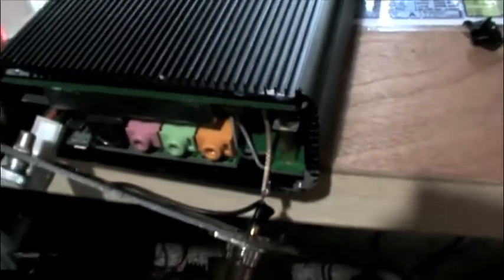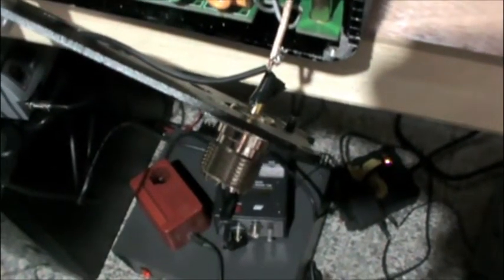I find it odd that they would paint through the holes where things would be connected to make a good electrical contact. Problem was when I took it off, the flimsy little piece of wire that they had going from the shield on this little coax down to this screw broke off. So as you can see, I soldered a new piece on. I'll reattach that, cut it to length, reattach it, and get it all back together.